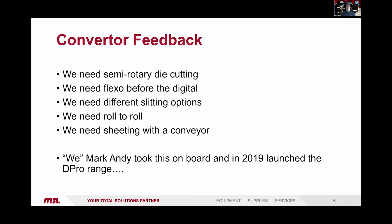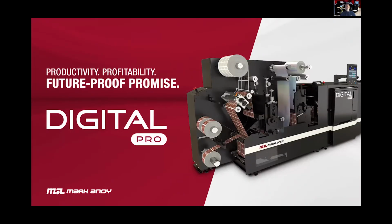So the feedback we had was semi-rotary die cutting rather than just full rotary, a flexo before the digital engine to allow for whites down on clear materials, different slitting options, so not just your standard shear knife slitting, a roll-to-roll version, so rather than just a hybrid, and then sheeting and conveyor. So we, being Mark Andy, took that on board, and in 2019, we launched the Digital Pro range. So here's the new machine. This image shows you a Digital Pro 3 with a semi-rotary die station.